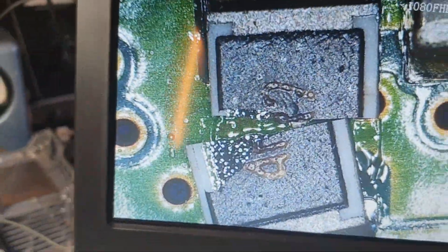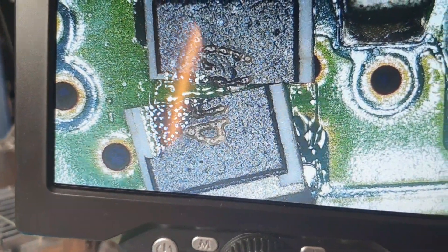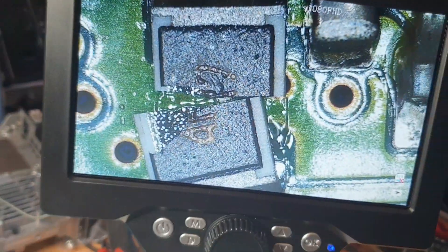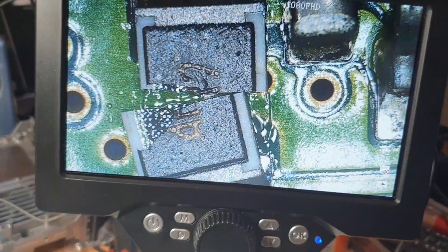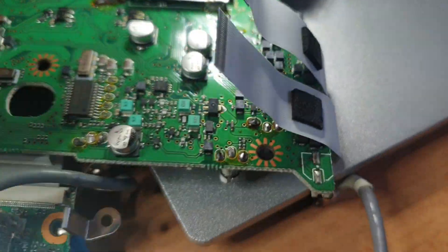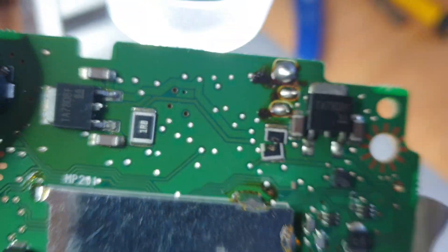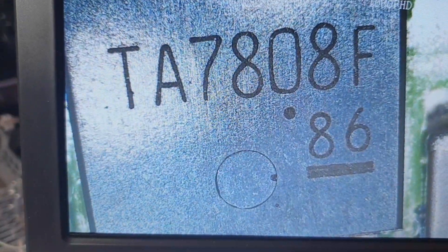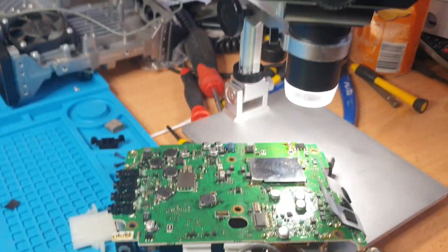Let me grab the circuit — my eyes aren't what they were. It's an eight volt regulator; for some reason I was thinking five volt, but it's eight volt. And actually had I looked closely at the part itself, you can read it right on there: it's a 7808. So instead of pulling the circuit out I could have just read the part — that's why we have these graphical displays.